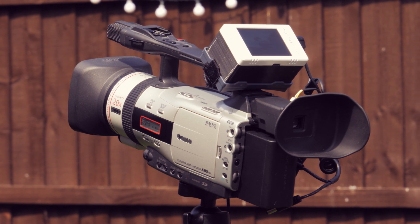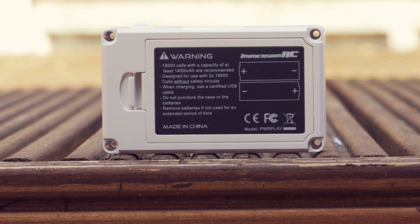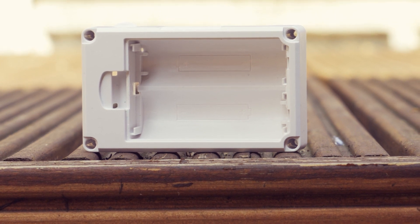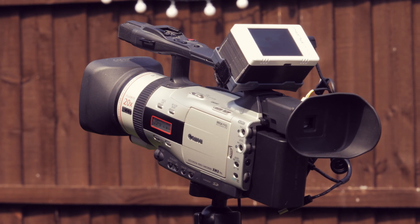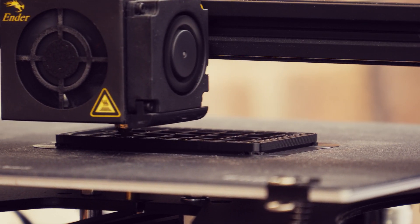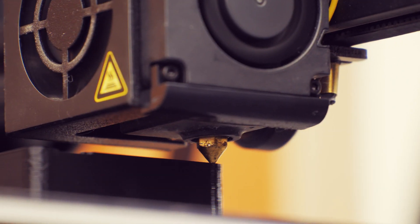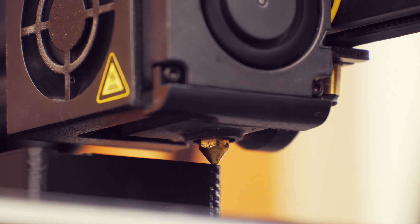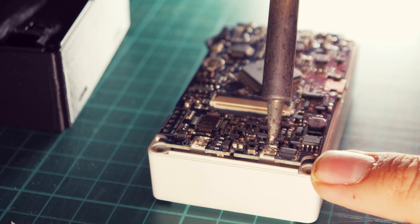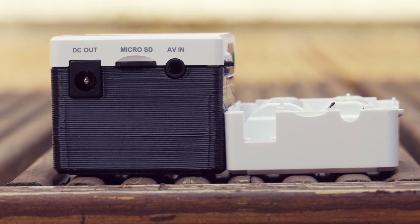On the subject of batteries, the PowerPlay used to come supplied with 18500 batteries in the box. A lot of reviews mentioned how rubbish they were so ImmersionRC opted to supply the current version without any batteries. This is fine and you can pick up a set on Amazon or eBay for next to nothing, but since I have a lot of 18650 batteries and can't resist a bit of a tinker, I decided to 3D print a rear casing that will accept these. It's not too difficult and MuteFPV made a great tutorial which I'll link in the description. This mod does add a bit of girth to the device but it improves the battery life even further and saved me having to buy any batteries.